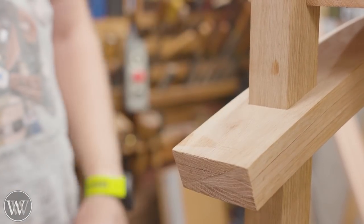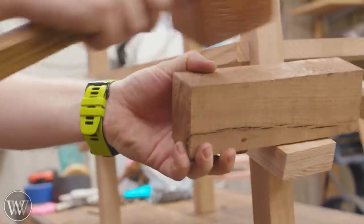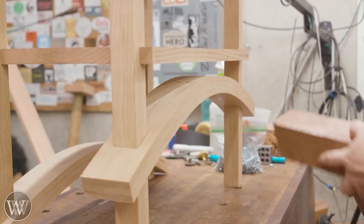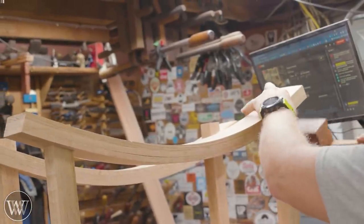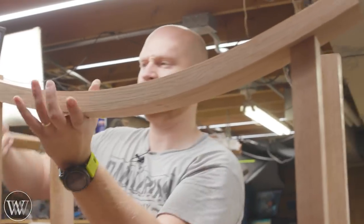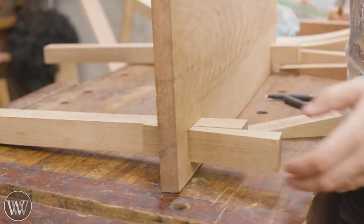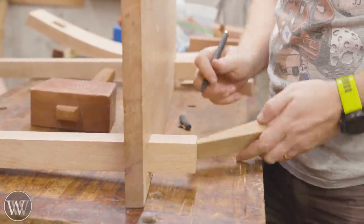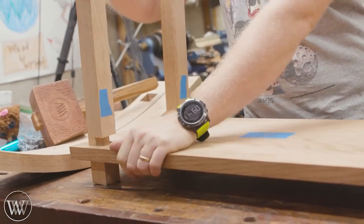Let's pick up where we left off. Last time we got this fully assembled and now we need to do all of the little detail things to make it happen. I want to make these arches a little bit shorter, so I eyeballed about how long I wanted them to be and marked them out on the frame. The loose shelf in there — I just decided to leave that loose and it will float and sit on top of these arches. I should have fixed that and done it differently, but we have to live with the mistakes we have. I'm going to be changing that in the plans.